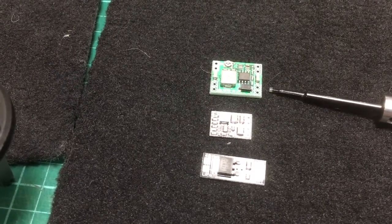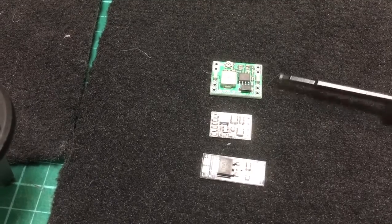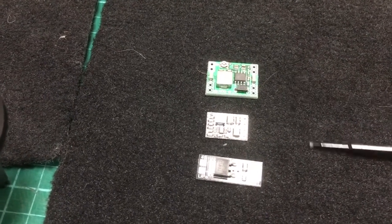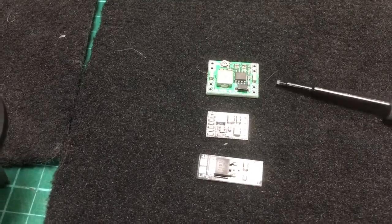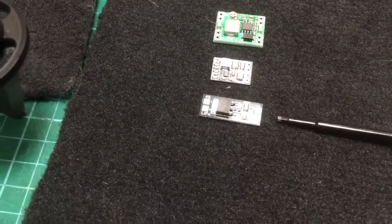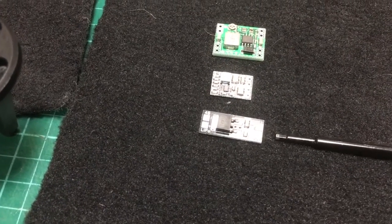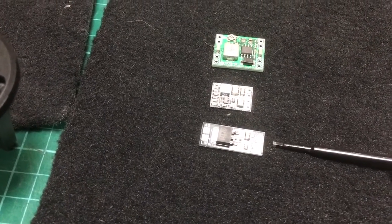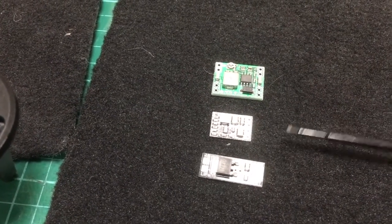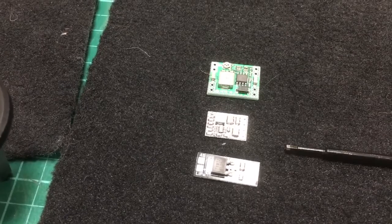So it's up to you. If you've got the carrying capacity, then the larger one is a good all-rounder. If weight is a concern, use the smaller one. I prefer to use the larger components, especially in this build, because it's going to give me less risk. That's your 3-amp BEC, that's one and a half amps, and that's 300 milliamps at 12 volts. So be careful — don't go mad. They may be small, but they're not powerful.